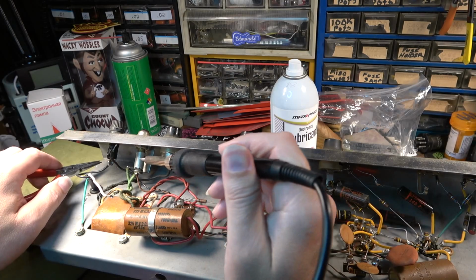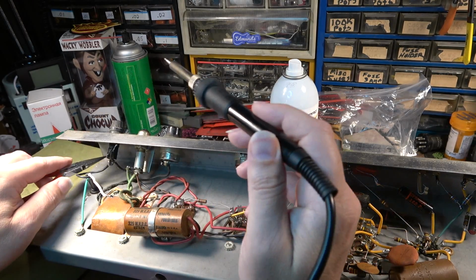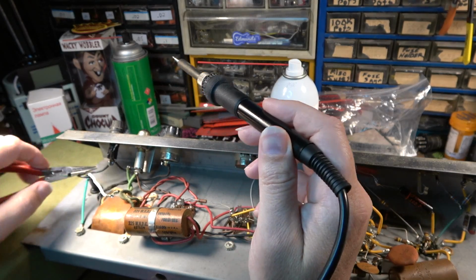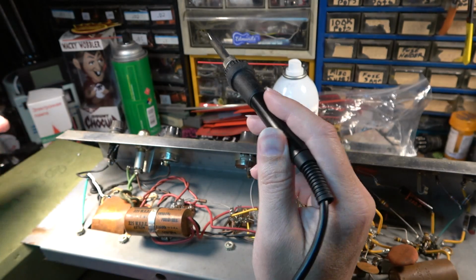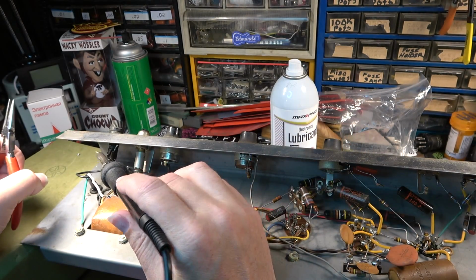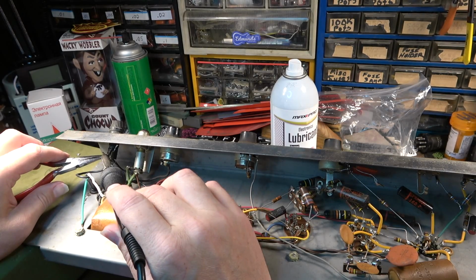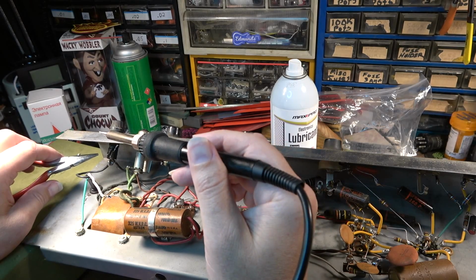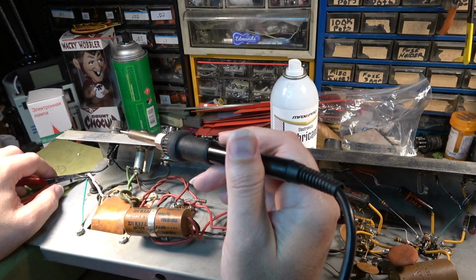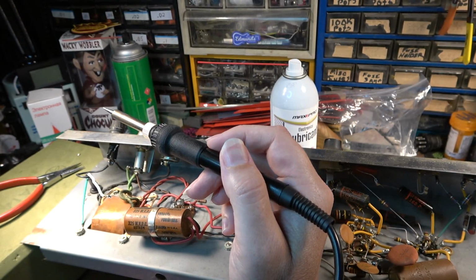I used to do it with the switch first, but I stopped doing it that way out of consideration for having a fuse in as many situations as possible where a short might occur. That's my thinking on that. That's also the thinking of, I believe, Underwriters Laboratories and also the CE, the European system. They also recommend this as well, I believe. So at least until somebody is able to convince me otherwise, this is the way I'll continue to do it.